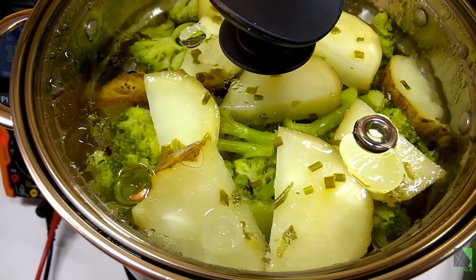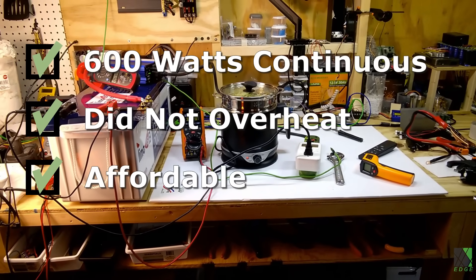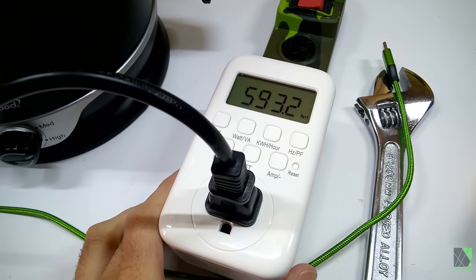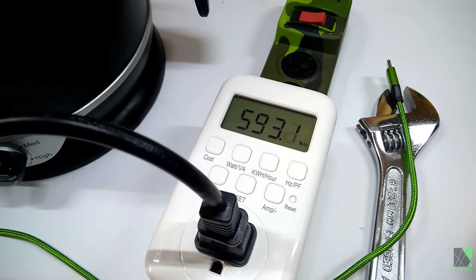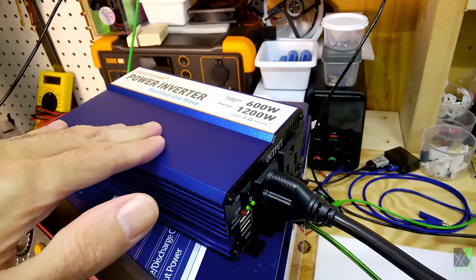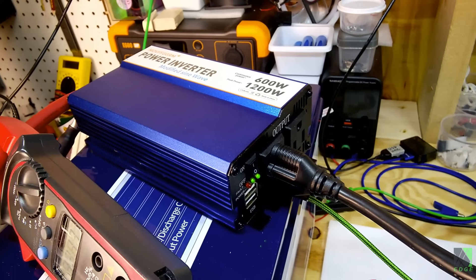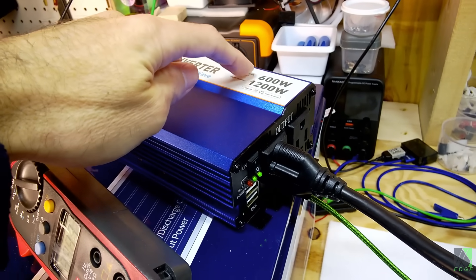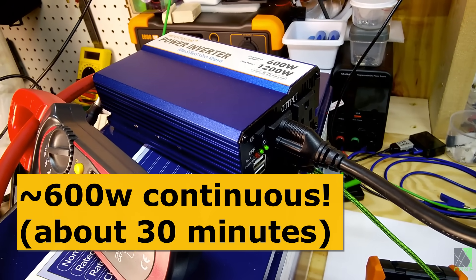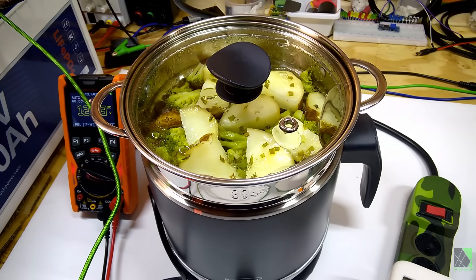Yeah, that's doing very well for a $37 inverter. This is not a formal review — I bought this inverter — and I think it's passed my test. I'm going to include it in my emergency standby power supplies. It's able to run a cooking appliance, and the inverter claims to do 600 watts — well, it's doing close enough to 600 watts to satisfy me. With a modified square wave inverter I can't 100% trust the watt meter, but I think it's close enough. I didn't expect it to deliver 1200 watts; it's the 600-watt figure I wanted to verify. This inverter seems to be holding its own and doing what it said it would do, which is a little surprising and a little impressive.